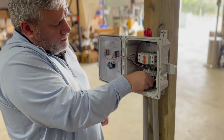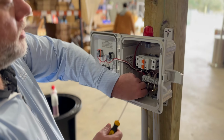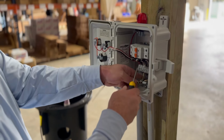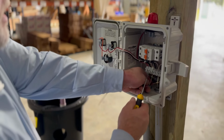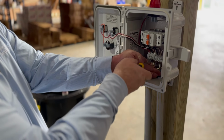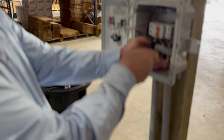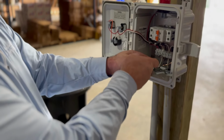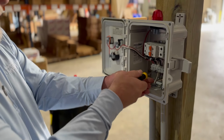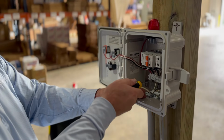So you're going to want to not put yourself in that position, and you run power wire out to a junction box, an LB. We put LBs on top of the tanks, and that will save you a lot of headaches because it's much easier to repair, and if you seal everything correctly, you won't have any problems, which is also important. You just don't want issues later.